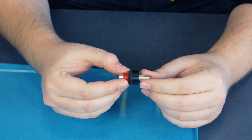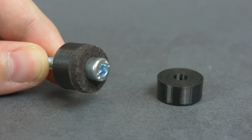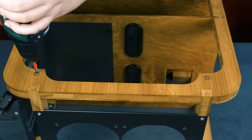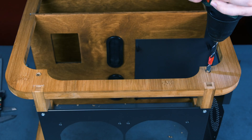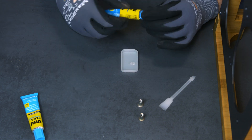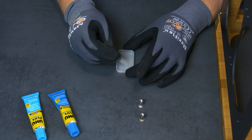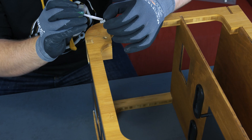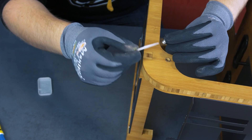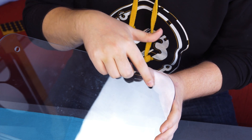So we came up with another mounting mechanism. We're now using screws at the top of the side panels to attach them to the frame. To make the screws work we need to create new standoffs so they can fit through. We also need to put a thread insert into the frame so we can actually screw the side panel to the case. For that we're drilling two more holes on each side and gluing them in. We're mixing up some epoxy glue to keep them in place.